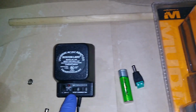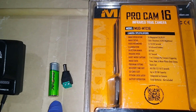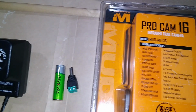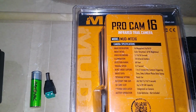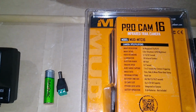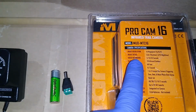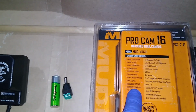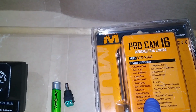Okay, that being stated, remember, as I'd stated before, and I need to state it one more time, if you're going to be doing this as a bench technician, please hold yourself to a higher standard. Do this preferably on a device that you can repair or that has a fusible link in it, whether it be round or square or whatever it may be. And in doing so, you'll be able to replace the fuse and keep the device working. Do not use this on your initial device. Use it preferably on an antique device where you can replace a fuse that might be built in or might be in a fuse holder.